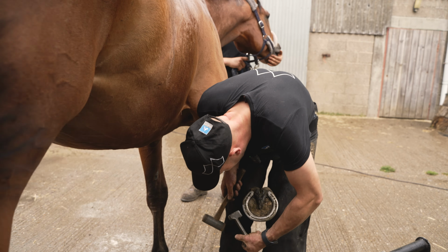So I use the pull-offs, and I'm just gonna knock the clenches up on there. Or I could use nail pullers, but I prefer to use the pull-offs. I go right at the heel and I give it a little pop. And once it pops, I can see the nail. Then I take the nail out, and it's quicker than using the nail pullers. Like that, off it comes.